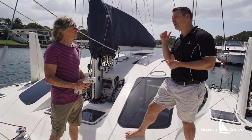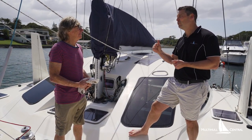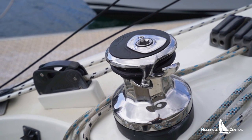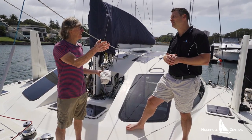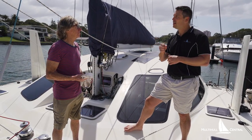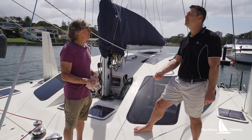So you've got manual winches back at the cockpit? The main winches at the cockpit are Selden two-speed reversing winches. So you can actually ease your sails under full pressure without complex arrangements with the clutches — easing that with the winch handle, either grinding on or grinding off, you can do both ways.